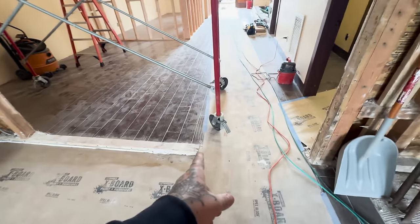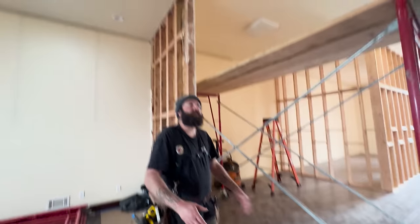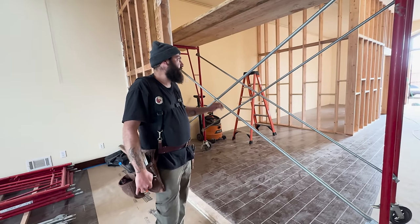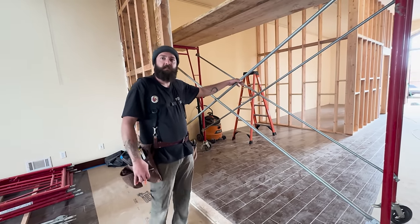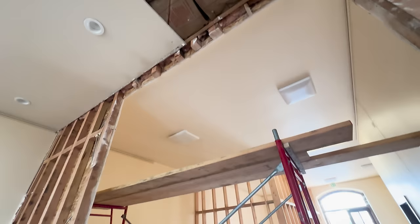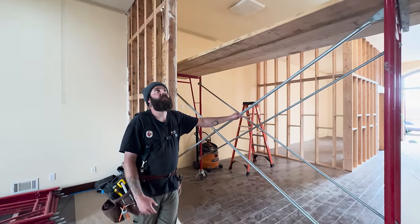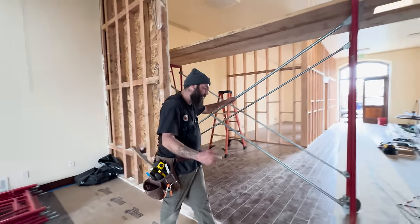I'm gonna reframe the timely door here. Put this back in. You wanna do this or you wanna do shear? What would you prefer doing? Do we want to blow and go on shear and then close the day out with cutting this and trimming it down? None of the cuts are straight. We have to cut through the drywall and the shear panel. Not like we can just blow and go with that. It's not going to be quick by any means.